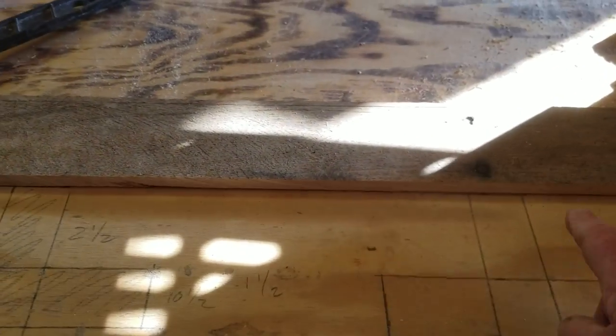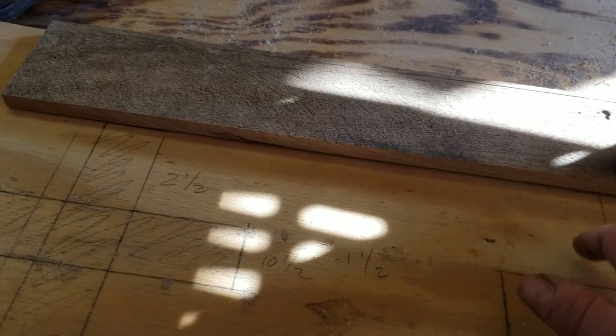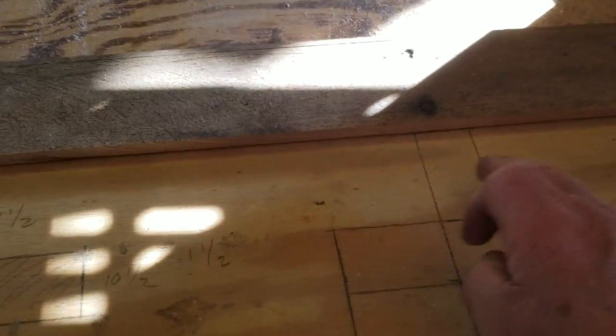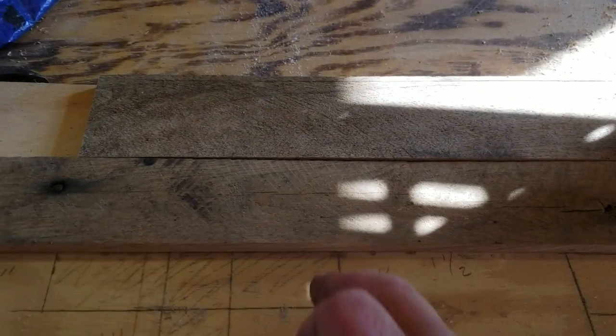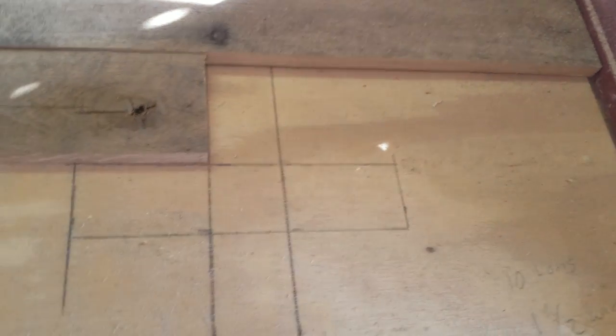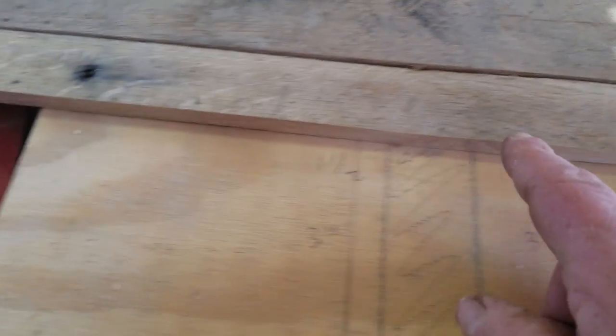Now I have a board at the top of the cross. I want one at the bottom lined up — I'll stagger them back and forth a little bit. Now I have this board which I believe is two and a half, so I'm going to rip down one at two and a half — it'll go here and on this side. There's your two and a half, and I'll use this piece to run across here. This piece right here is inch and a half, so I'm going to rip one down inch and a half.